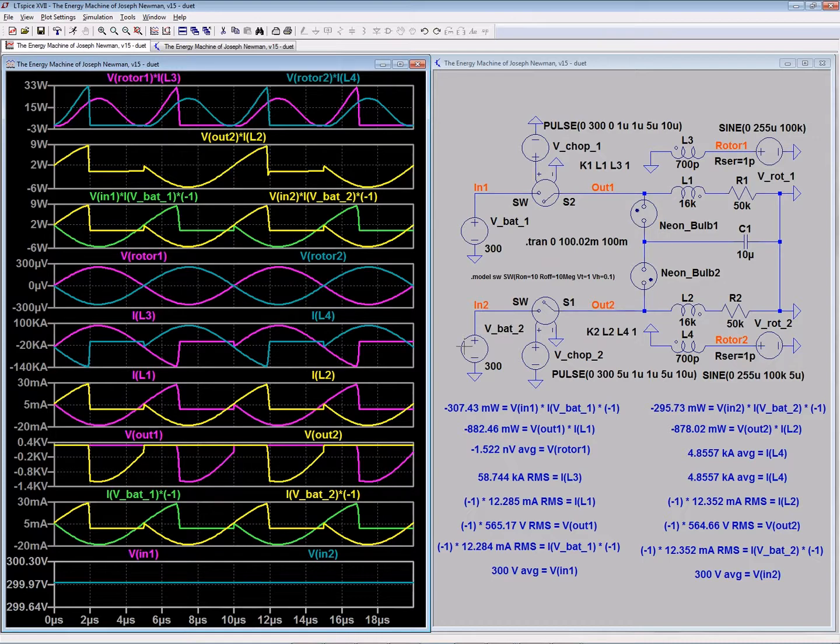So what I'm learning is, I never really understood RMS, and although I suspected RMS would be more accurate, the problem is RMS eliminates the sign value, and we have to know the sign value of these different components and combinations of components. I'm trying to find out the average over the course of these wavering waves that undulate up and down. Dr. Hastings used averages because then he could retain the sign value and note whether or not the battery pack was getting a negative charge instead of draining itself. And that's a good thing.